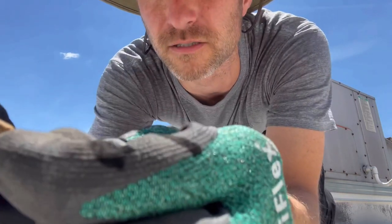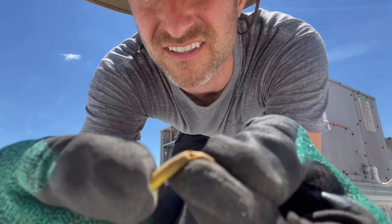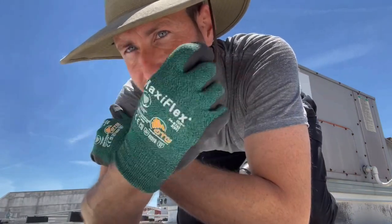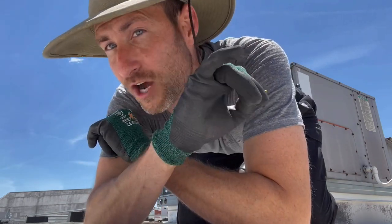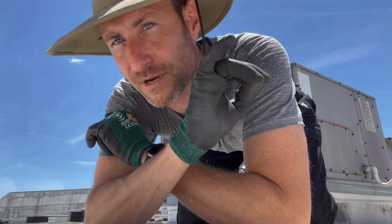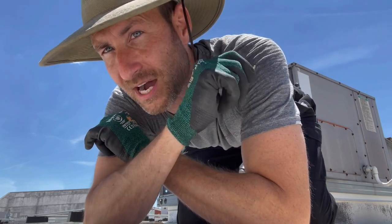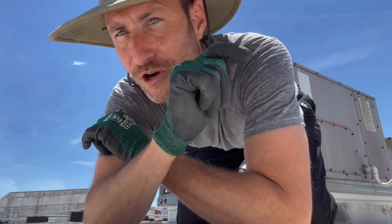There's that damaged piece of wire. You cannot have a direct short to ground — you do that, it trips your breaker. That breaker was off. It tripped before, somebody came in and went click, boom, and popped it. Guarantee you that's what happened. They left it off and said, call your AC people.